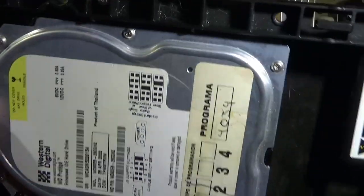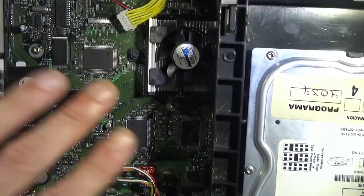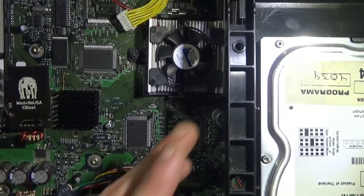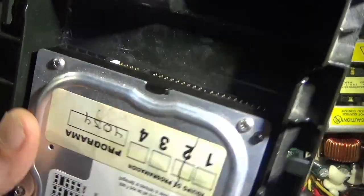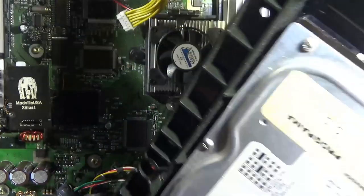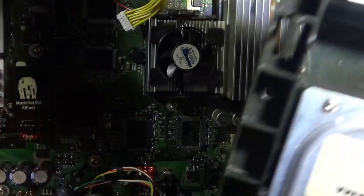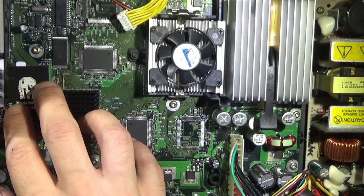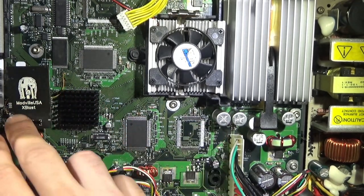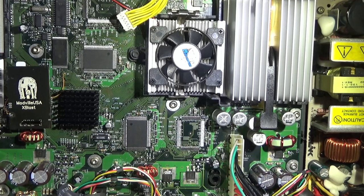keep these in mind. When you're setting up your console, Xblast, Xenium, whatever, if you don't want to deal with it, the first thing you do is unlock the hard drive and keep it aside, and hit Harcroft up, send it on over and we can dump it. What I've been doing is with everyone I mod, I unlock them, I let them stack up a little bit, and then I'll come in with my Xenium, boot it up, go through the hard drives and back up the contents of the E drive to individual folders, and then I'll send that over and they can see if there's anything special on there.